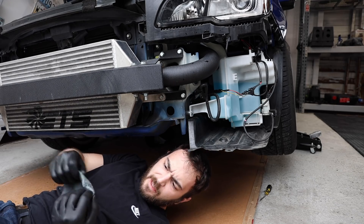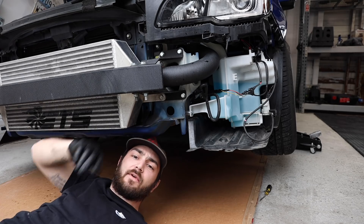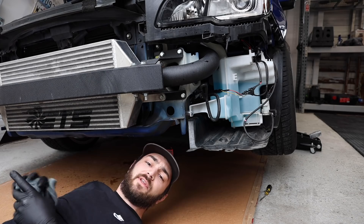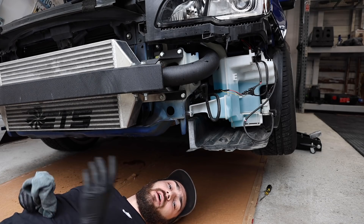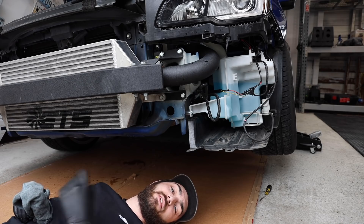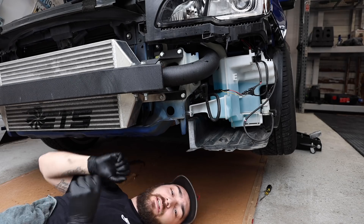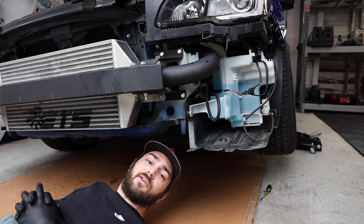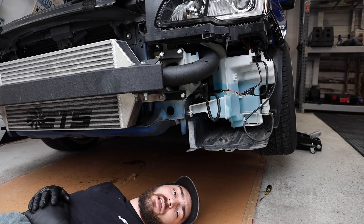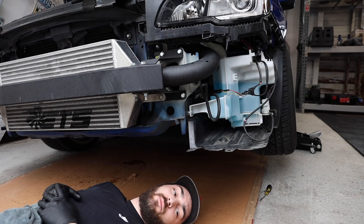Got it cleaned out — there's some of that red sealant on the rag, so it is a good idea to actually clean that out. Do not bypass this step if you're doing this at home — do it right the first time. Don't leak coolant out of your cylinder four cooling mod. Now I'm going to let that dry for a couple minutes, then we'll get the new cylinder four cooling mod threaded in. Remember, the block is aluminum so you don't want to over-tighten it. Dom doesn't give a torque spec — he just says get it good and tight, but not too tight.